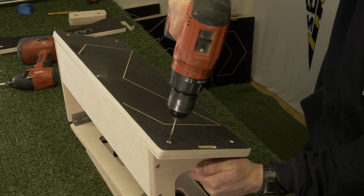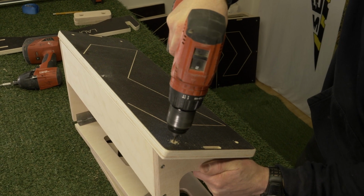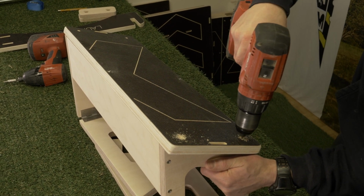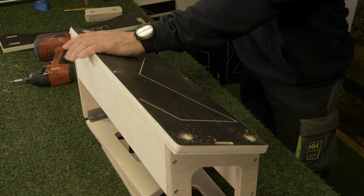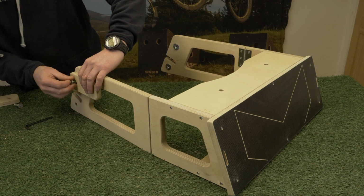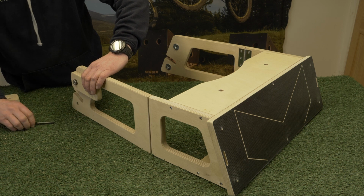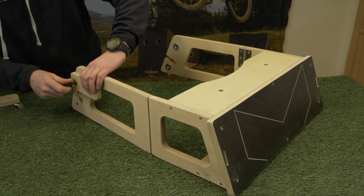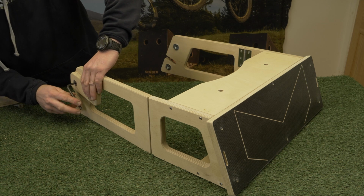Finish the assembly of the 650 by carefully going around the remaining holes. Pilot hole into the end grain and secure with 5x50 screws. Check all screws are flush. Take the 2 wood fixing blocks and 2 countersink M10 bolts and secure these into the T-nuts you see here on the legs.